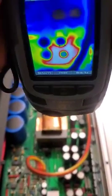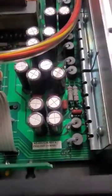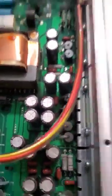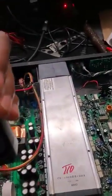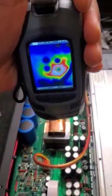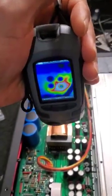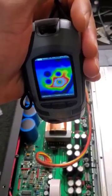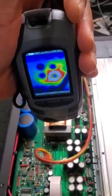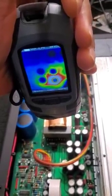What's going on is these caps are bad and they're drawing too much current. Let me go ahead and turn this off before it overheats too much. Even with the power off, you're still going to be able to see the heat. You got four caps configured in a square, then an additional four, then another four. Right here where that second bank of four is — that's where the problem is. That cap toward the top right has a lot of white light around it and a red rim, meaning it's extremely hot.